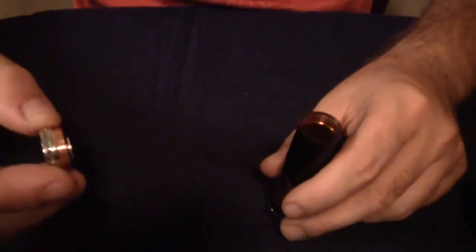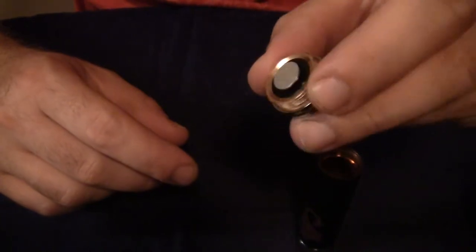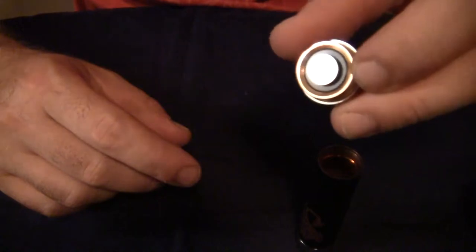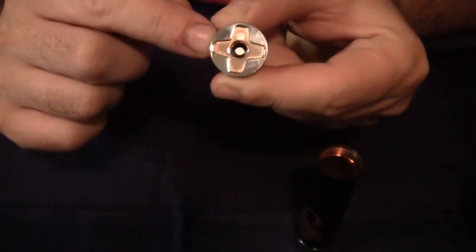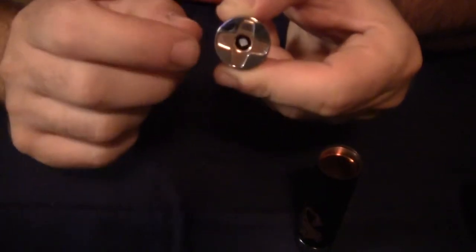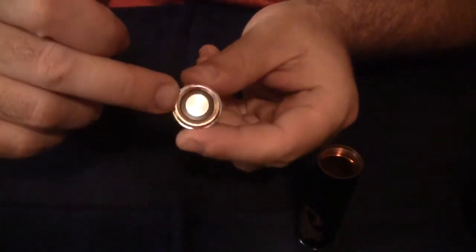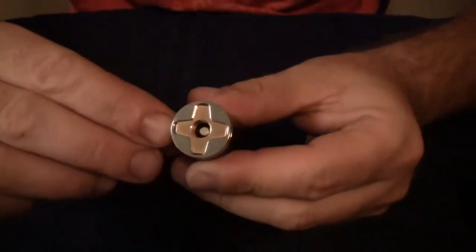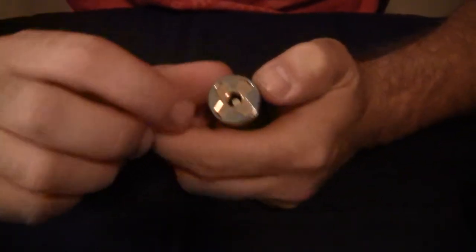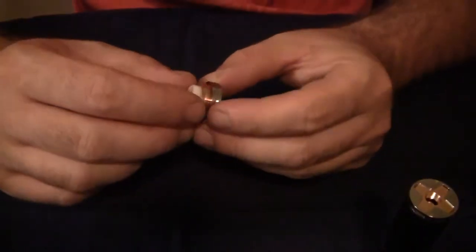Now the top cap has this floating center pin. So far that hasn't been any type of an issue, but it's not spring-loaded — it's just free-falling and nice and loose. You've got your stainless steel, which I'm going to assume is 304; I haven't found any specs on these because I cannot find the manufacturer. Then you have the copper inlay, and inside you have what I'm assuming is a silver-plated brass post — that is your top cap. On the edges of each end of the inlay there are little grooves where you can get airflow through, so it is a vented cap.